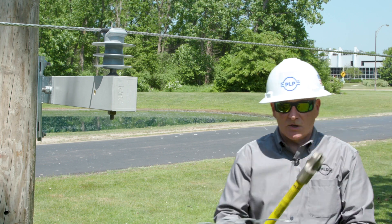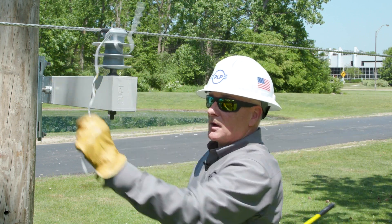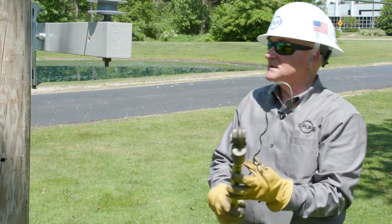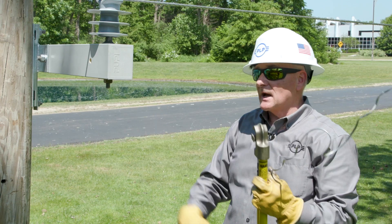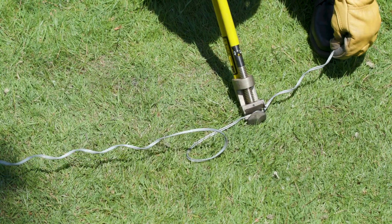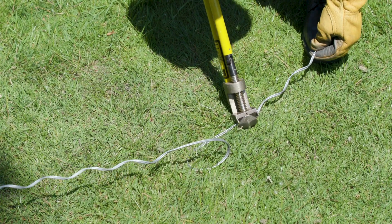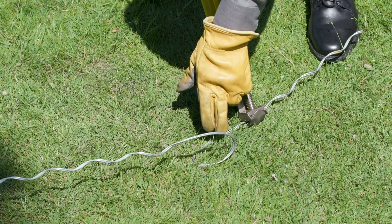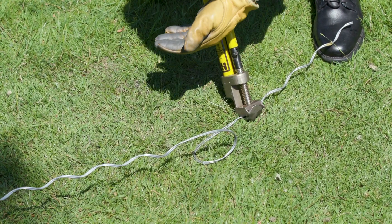What I really want to show is you'll want to hold your tie like you would install it on the insulator. You'll come down and grab it on the left hand side of the tie in this configuration, with your insulator on the outside of your cross arm in the position I am. You'll want to grab the tie on the left hand side about where the color mark is. You'll tighten your jumper holding tool sufficiently to hold the tie in the orientation that you have it. Note that when you install it, your crown is up — the opening of the crown, which is going to sit on your insulator, is down towards your stick where you're going to be holding it.